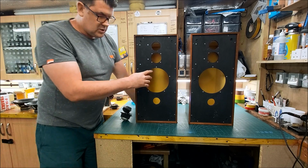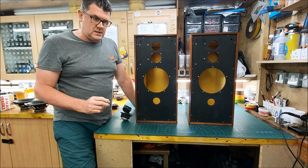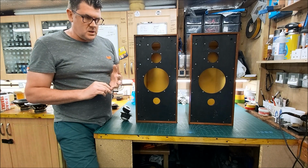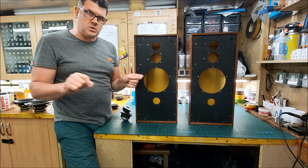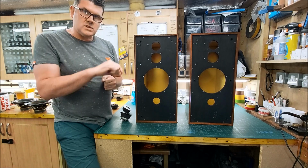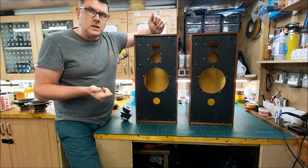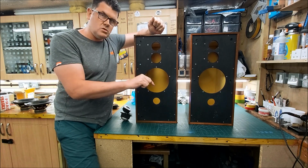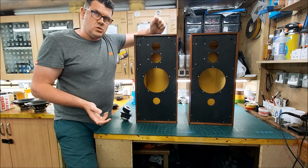Now, the original woofers that go in these, I've repaired no end of them. Most of the time they suffer from cone sag, so they need a bit of realignment, but the main culprit is the tinsel wires or lead wires coming from the voice coil to the connections. They just fracture, and whilst they look intact, they have a piece of cotton inside them that holds them all together. They break, often at the terminals, but sometimes where the tinsel wire goes through the bobbin to pick up the voice coil. And if that's happened, it can be really difficult to repair them.